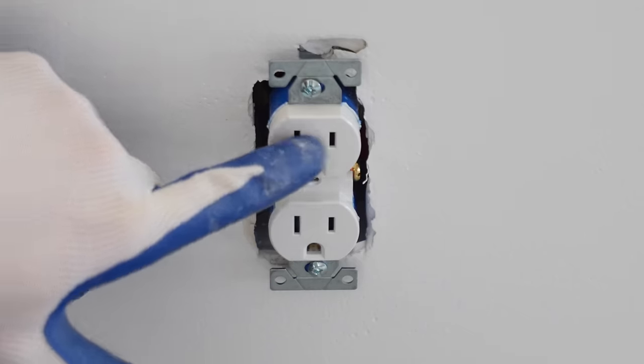And now the same idea for the housing. Take out one of the screws and just loosen up 2. Now we're going to take our LED light, plug it in, and then place it on those screws. And plug it in where the blue goes to the blue and the white goes to the white. Now we're going to install the light. And now place the screw back in the hole and tighten up the other 2 screws.